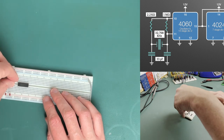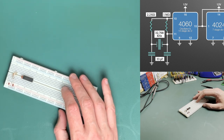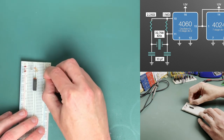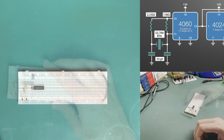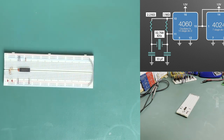Ideally just between the positive pin - the voltage supply pin - and the ground pin at the bottom. So for this board I'm going to pop that in here. Then we need to hook up the positive supplies to both of those. Now we just need to ground off the pin to negative and the other side of that capacitor. All we need to do now is just ground off the enable pin, which is the fourth one along from the top right.